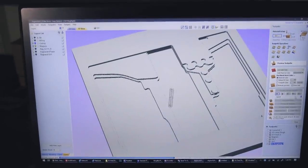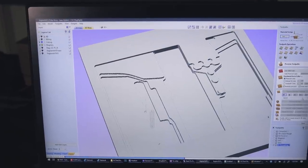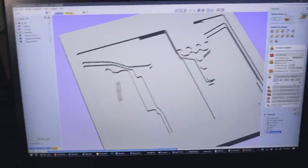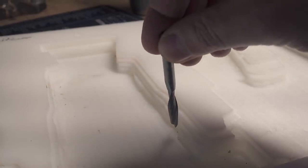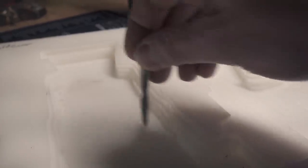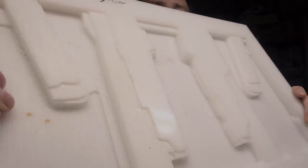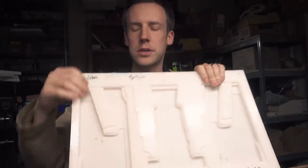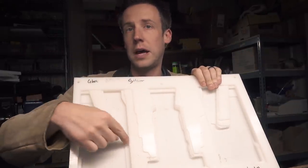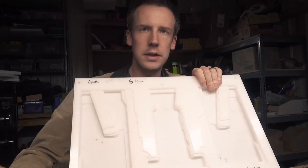There are a couple of ways to generate a roughing pass. The first is to remove material one layer at a time. You can see where the big bit has removed an eighth of an inch of material on its way down to create a shape that can then be smoothed out with the smaller bits. For certain holsters that's great — like this sidecar — because we actually want two different levels of flat surfaces for the kydex to be formed against, and being able to make those flat surfaces with our roughing bit is fantastic.